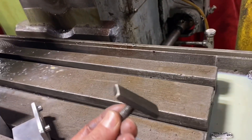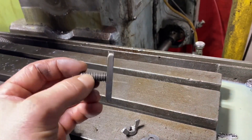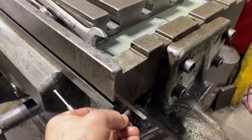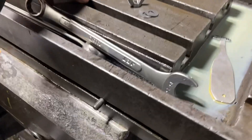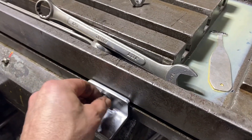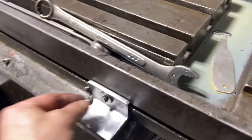Then I took a piece of flat bar, wound a bolt into it, cut it off, welded it, and did a bunch of sanding. So now we have a little T-nut that slides in there — it goes on with one or two washers, whatever you please.